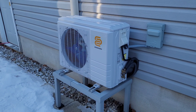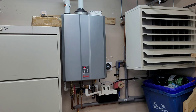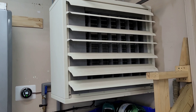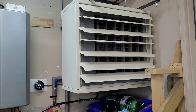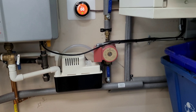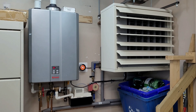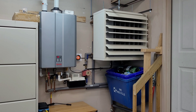A couple of you have asked me in the past for a quick rundown on this unit heater, so I'll finally do that. This tankless is tied into my house — it goes through the wall so I can run domestic hot water on it if I want. I also have a standard 40-gallon water heater in the house. I got this on Facebook Marketplace for $200 — brand new, sold as an air conditioner. It's just a water coil with a fan in the back. You turn up the thermostat, it clicks a relay, turns on the circulation pump, there's about a 10-second fan delay, and then it fires up and blasts you with good strong heat. One con is it's pretty loud — that's why I like running the heat pump overnight; it's silent and you can't hear it from inside, whereas this is right up against my daughter's room.